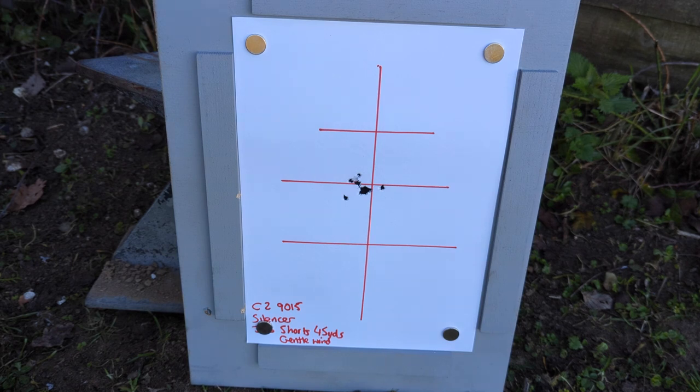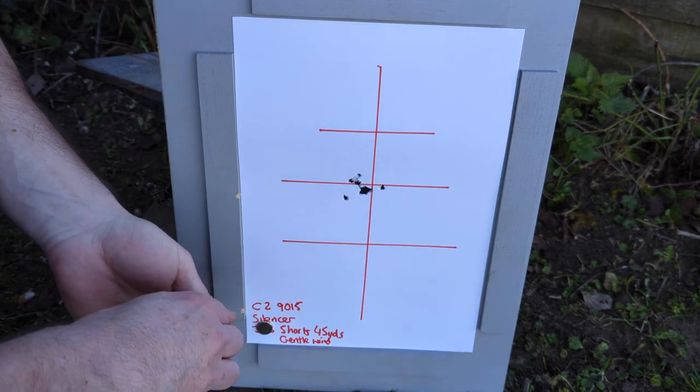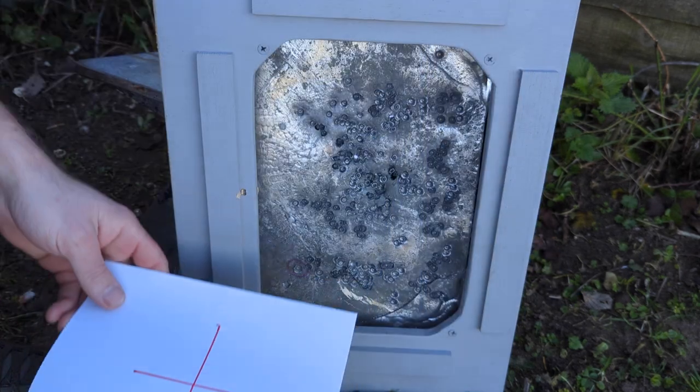We'll get the air stripper on. It's got an adjustable cone in the air stripper. What we'll do, we'll set it up. I'll set that cone initially at 4.5 mil from the end and we'll see how it goes.